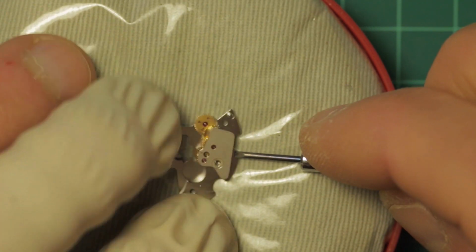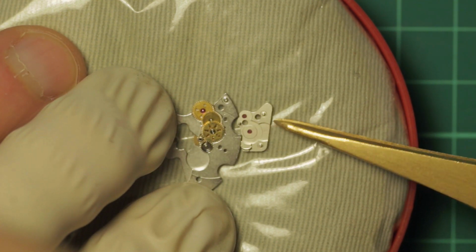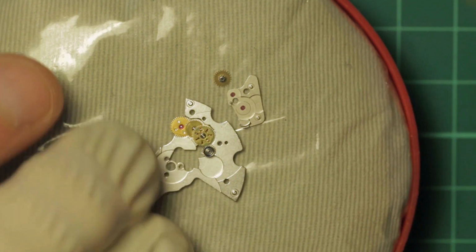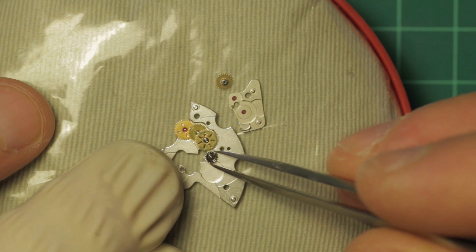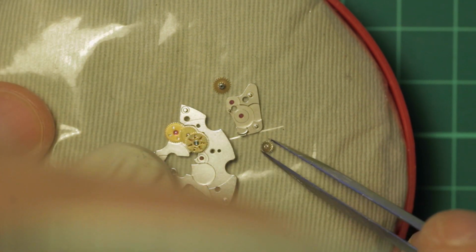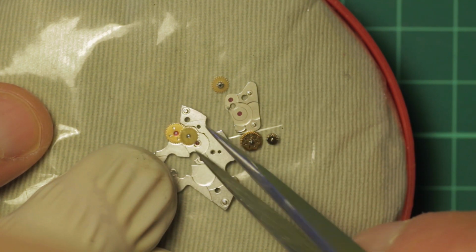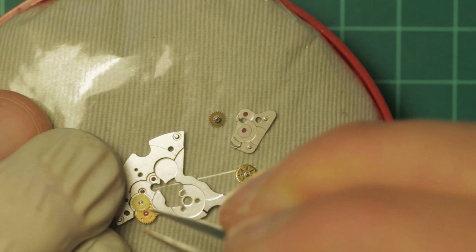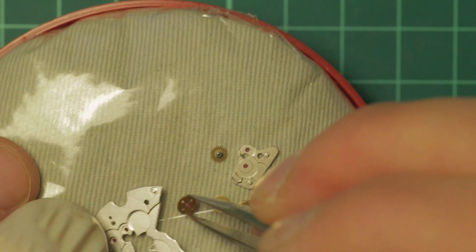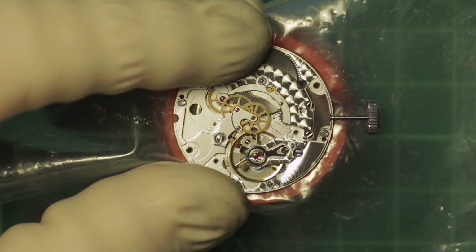This is the first time this particular watch has come apart for servicing, and accordingly some of the fitments are a little tight. The wheel that's come loose there fits on the other side, the upper side as it were, of the automatic winding works, and it's important to note that that must actually be in the correct position before fitting the bridge that holds all the wheels together. Otherwise it will not fit in afterwards. And here you can see the 4 wheels that make up the underside.